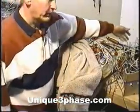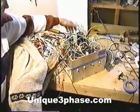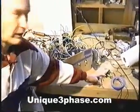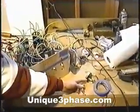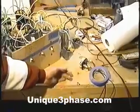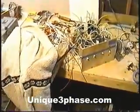Let me show you right over here — I've got the board here. Those of you who have my videos obviously know what this stuff is. I had four start capacitors, series-parallel; I disconnected this one right here simply because the start relay wasn't working correctly, which I also show in the video. Here's the start relay right here — it's a JPR-68, I think. You can have it for $17 from McMaster-Carr. I'm just showing you that even when you're running the motor on 400 and 500 volts, you can still use these little relays — they work fine. We just adjust the taps on the transformer where we take off the signal voltage.